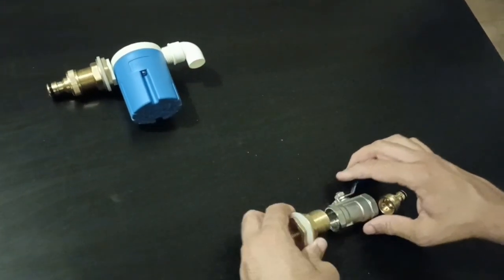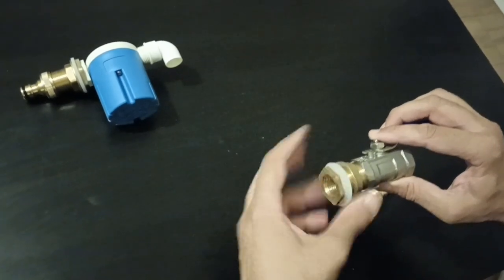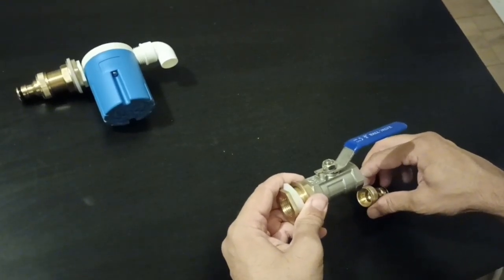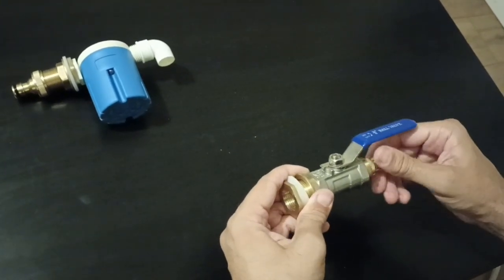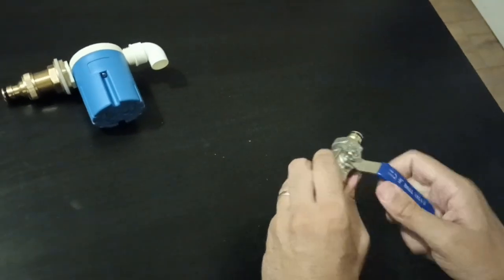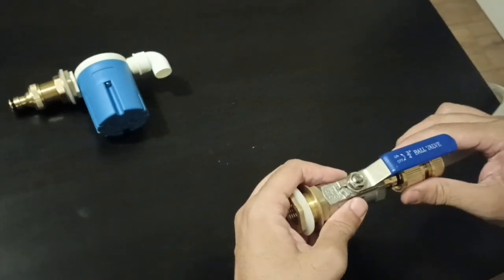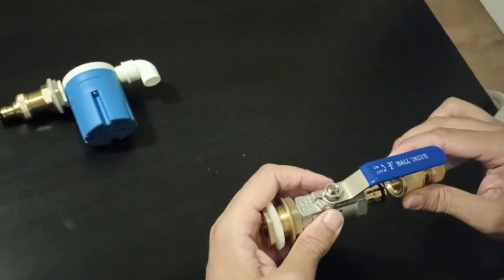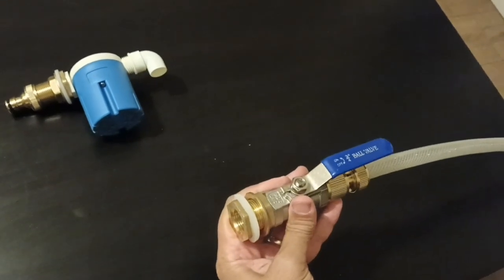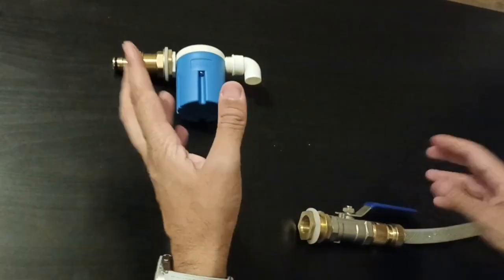This is the outlet, which will go to your machine connected by a short pipe. We've got our connector here which will go into the ball valve like this — screw that in. Then on the other end we have a brass three-quarter inch hose quick connector. This lets you control the water: you can shut it off or turn it on by turning the valve. I picked this up from Toolstation for a couple of quid — this brass quick connector — and that will then run to the machine, my Wilkes TX625.